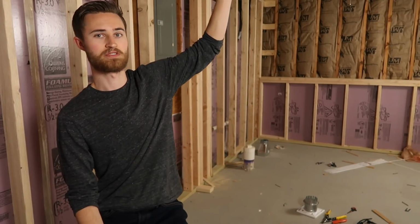What I'm planning on doing, I've got past recordings of the drums down here recorded from the kitchen above. No insulation, nothing in the ceiling. So now we'll redo those videos, and we'll have the drums down here playing, and we'll have the mics up there, and we'll see how much of a difference the R38 insulation and the 2 layers of drywall with green glue make. I think that's going to be pretty cool and pretty interesting. So that'll be down the road in a few weeks as I get closer to having the ceiling done.